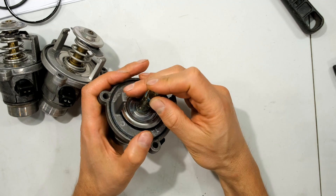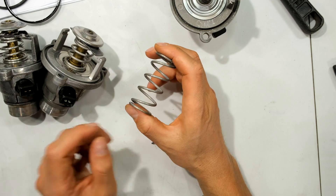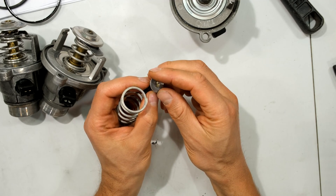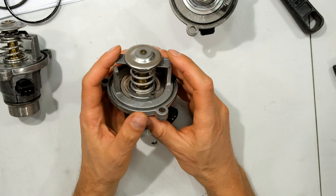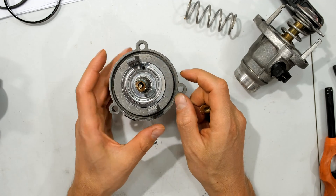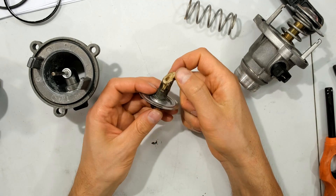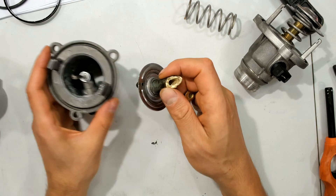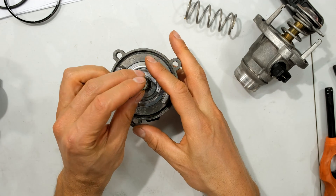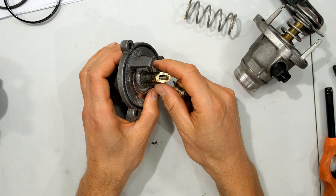In order to make this open at a lower temperature, one could do a few things. The first is to change the spring — that is quite hard because you'd need to open the end, maybe drill it out and rivet it back, which I don't recommend. Another option is to reduce the internal volume — I've already been playing around with this and reduced the size by hammering and squashing it. That would create more pressure inside and therefore it would open at a lower temperature.